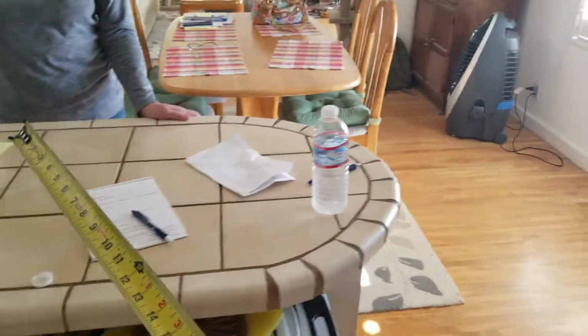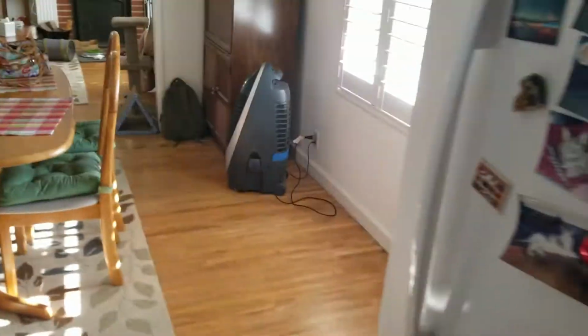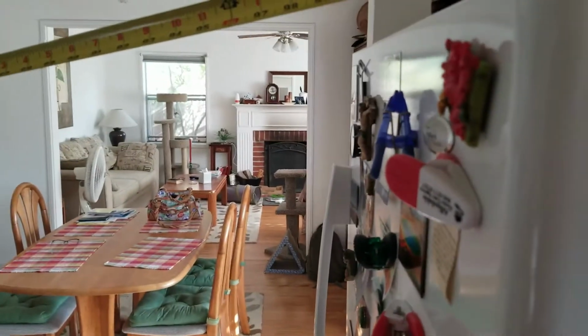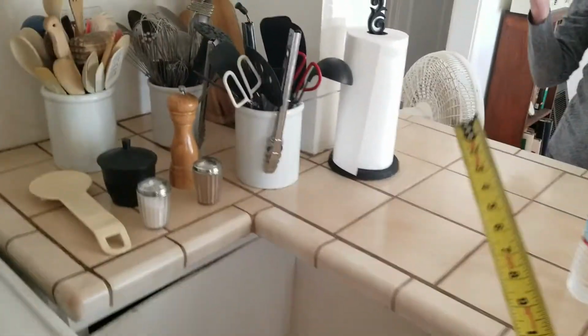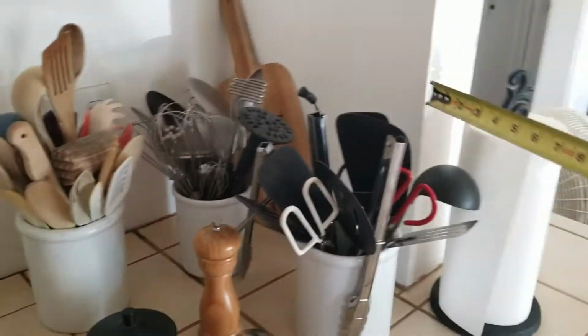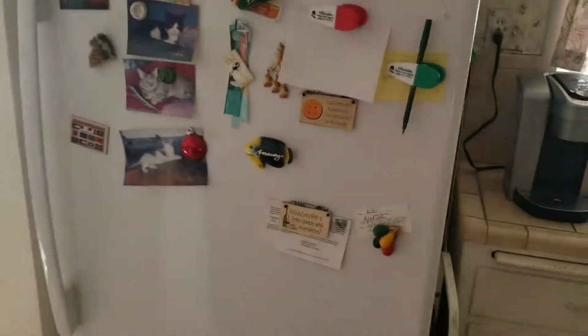This opening here, let's at least put this counter here. At this point, it's approximately 103, 104 inches, but that's probably a meaningless opening, because if there's a fridge here, we may build this out to a counter depth height, and then there's no need for this wing wall to be quite as deep. It'll only come out maybe as far as the counter, or we may actually get rid of this and have an open counter, depending on what's happening with the load on the wall.